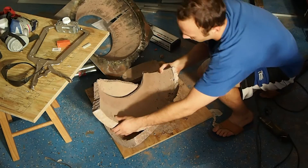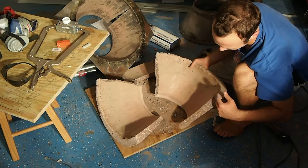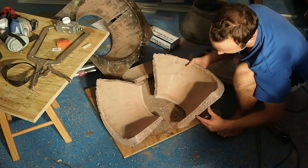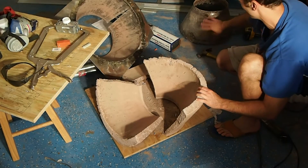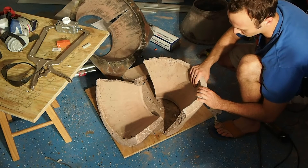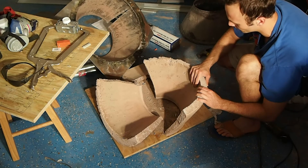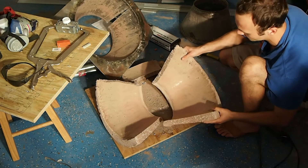So that's the update. We'll be changing the recipe for next time. I won't be using any Portland cement. I'll be using less perlite, and I won't be trying to shake or table it into the form. I'm just going to pack it on the outside and then go ahead and put that around it. That's the plan and I'll definitely do a video of me in progress while I do it.